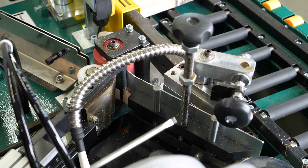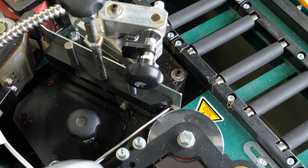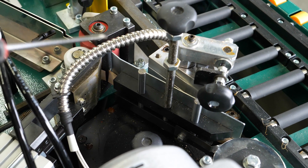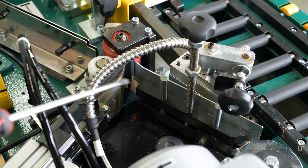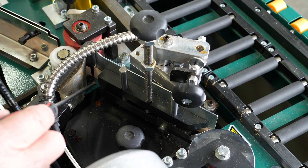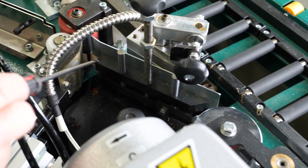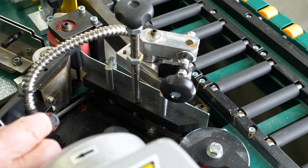Now I want to bring your attention to our edge seat assembly right here. As you can see, there is a piece of edge banding tape currently lodged within the seat assembly, but it has been severed on this side. That will inherently cause problems with the edge banding tape being able to feed properly or attach to the side of the board. You need to make sure that it is completely cleared out — I pulled out one piece but there is still another piece in the back that needs to be removed.